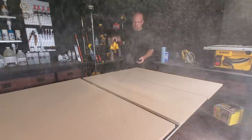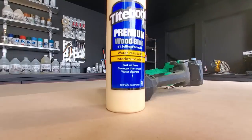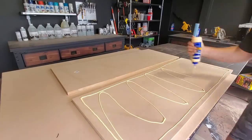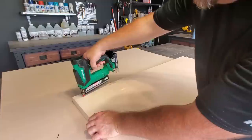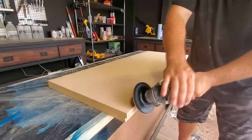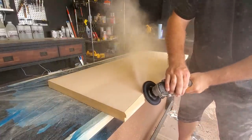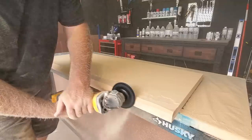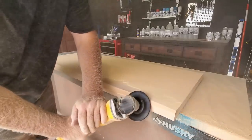Because this desktop is going to span itself with no support underneath other than the filing cabinet, I'm going to stack two pieces fully on top of themselves to get more rigidity. I'm using Titebond II wood glue and some 23 gauge pin nails. Then I'm going to use a 50 grit metal sanding disc to carve in that organic live edge, that rock edge. The more you make it rough and tumble, typically the better it comes out — that's a pro tip.